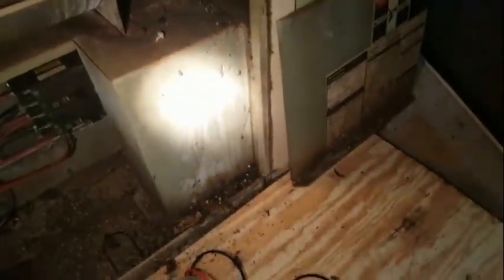Holy crap, look at that. Look at that right there, guys. I'm not checking this blower for anything. We're going to close the door and test the system with these little bugs in there, I guess. Good grief, look at that. Looks like they've killed a lot of them, but there's a lot of them left. Wow. Well, we're not going to check that capacitor today. I'm going to advise it gets replaced because most of them are bad. But, I mean, good grief.